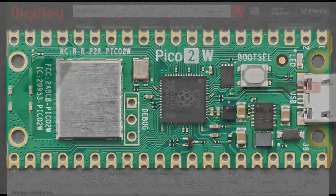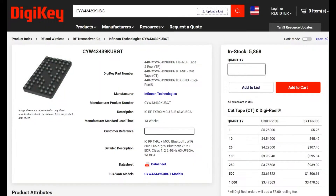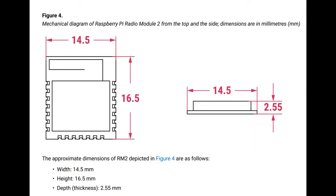You can buy this chip from DigiKey directly — it's even in stock. But interestingly, for basically the same price as buying a couple of chips, you can get a ready-to-go module. This is a BGA chip; you also need a crystal, an antenna, and certification — you probably want to tin it too. Before you know it, it's basically $4, so you can just buy the ready-to-go module, which has big castellated pads. It's very compact and fits onto your dev board or final product without having to embed the entire Pico board.